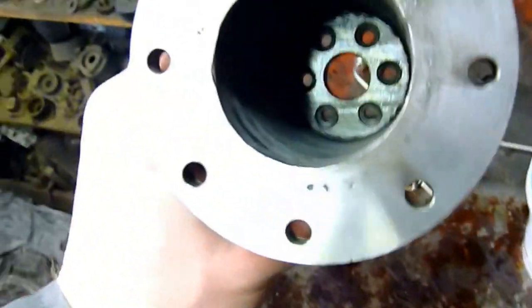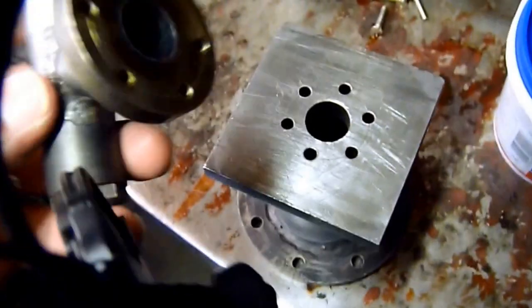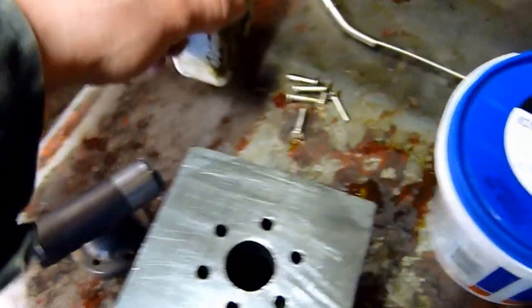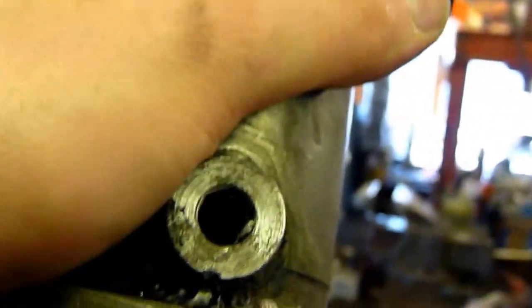I'm not quite sure what's the best approach after I've cleaned this up, but we'll suck it and see. We're going to join that to this now. There's no gasket — I've just got both faces machined off absolutely flat and I'm going to use some high temperature gasket sealant to seal it up. I've lined it all with fire clay, poked a bit in here and then pulled it out again, so it's clear — you can't see through it but I can see it's clear.